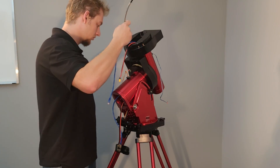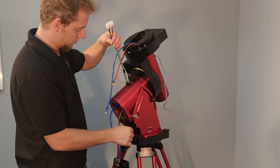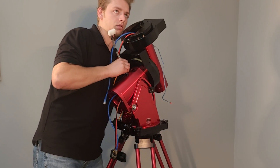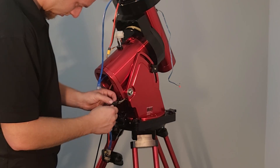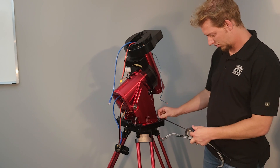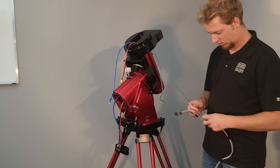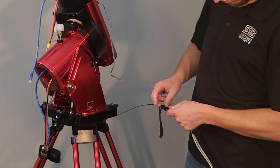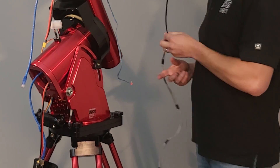This can be tricky, so have patience and take your time. Prepare the deck motor extension cable the same way and route it from the upper deck hole to the lower hole. After that, it can be routed around the deck shaft following the Ethernet cable and out to the RA rear. From there, push it through the RA base to join the other extension cable.